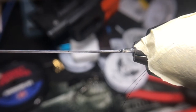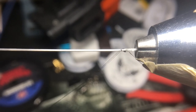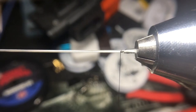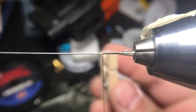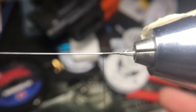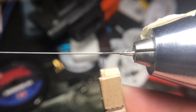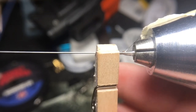Now you're going to have to start this by hand, and then you're going to apply the pin. I'm just holding it with my fingers down below because I've got the baggies down on the floor. It's really hard to do with the video going. So now I'm going to come up behind it from the drill side, because you don't want to come from the swivel side. It's going to have you pushing your wires back, and they're going to buckle up on each other. You don't want that to happen. I'm just going to pinch onto the wire right here. You see that beveled end in the front of that nose? It's so hard to do with the video. So I'm holding tension on there and I'm pulling up to it. Now it's up on there. See?